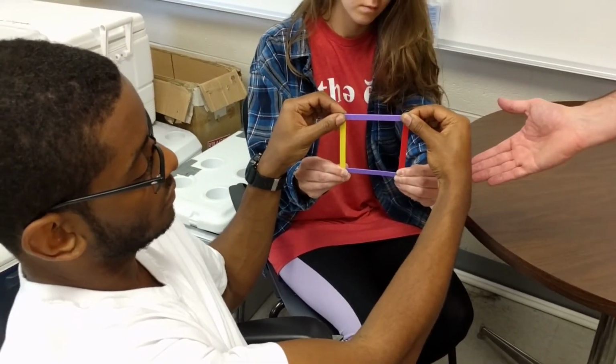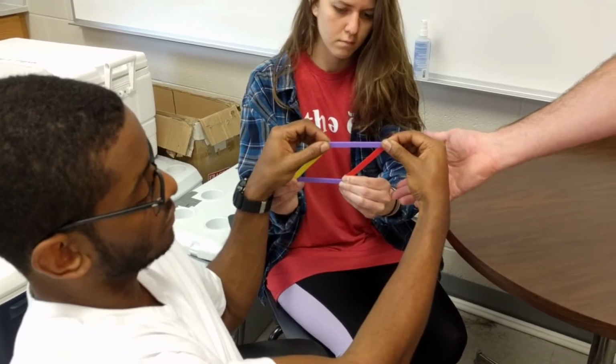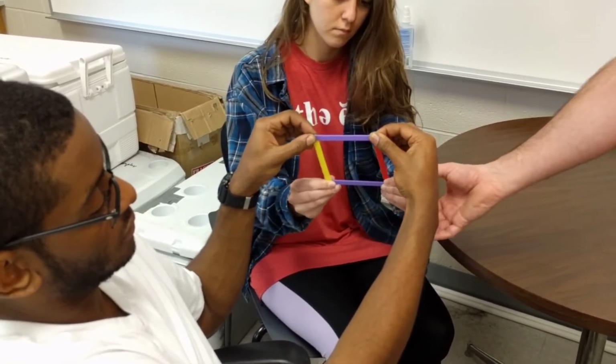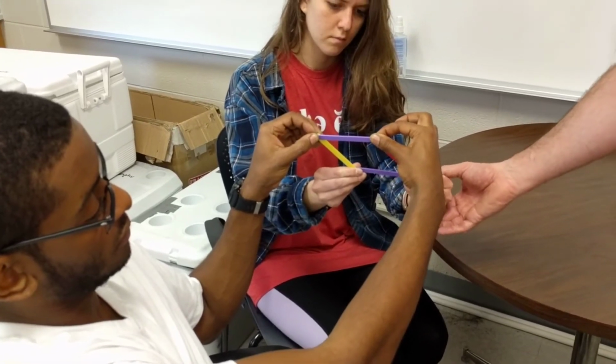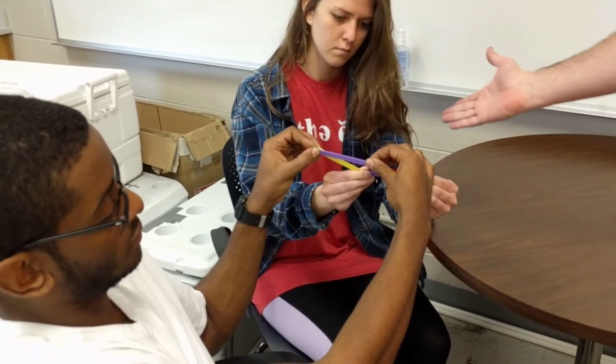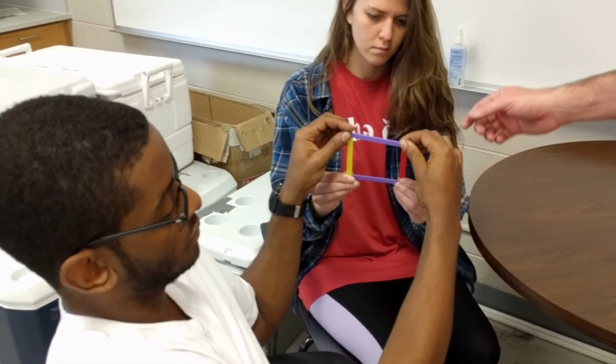Now, if we have movement of the bottom of this square, you guys see that it folds over fairly easy, right? Coming back the other way. And this is simulating an earthquake. Now, when it's in this position, we have gravity pulling down, and it will crunch down and the building will collapse. Now, let's look at it if we have a triangle shape.